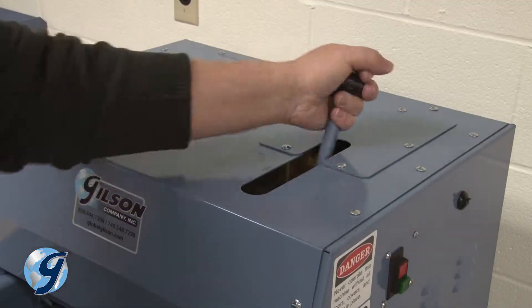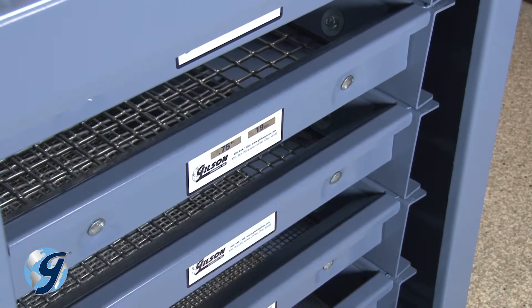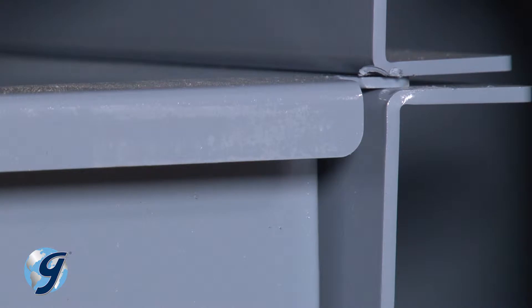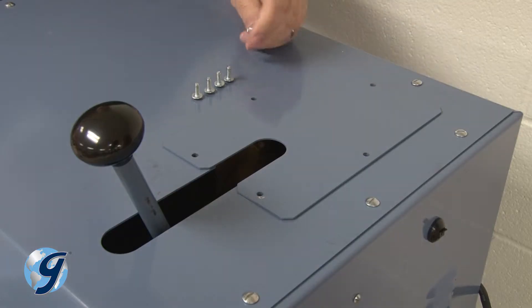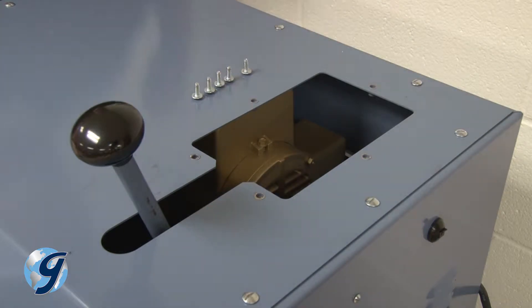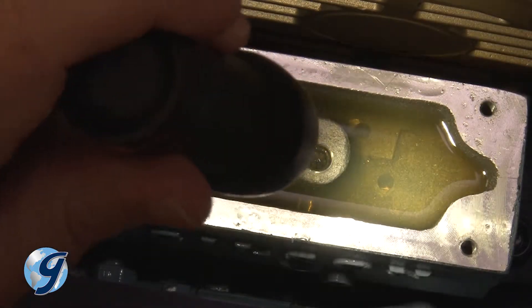The testing screen uses a quick-acting hydraulic pump system to clamp and release the screen trays within the unit. It is important to examine the hydraulic system for leaks before placing the unit in operation and regularly thereafter.